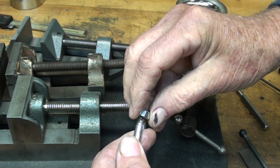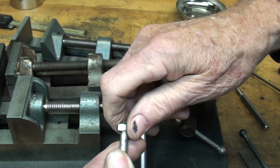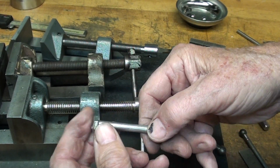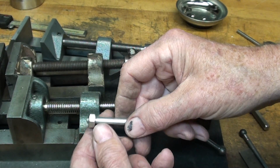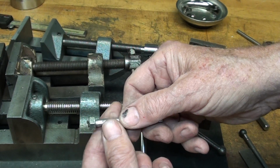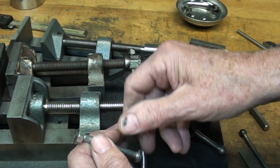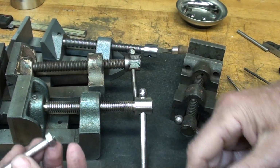Now in the machine shop, we could use the lathe, and that would clean up pretty nice. Sometimes we started with a bolt, and that already had a head there, and it could be faced off. But what happened is the kids would take this onto the grinder and grind them. Well, if they're holding it on a grind wheel like this, it's going to spin off, and bang, you could hear them fly across the shop. So I would tell them to hold it this way, and that would be self-tightening, but, you know, that wasn't really going to happen.